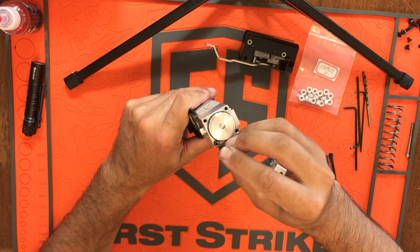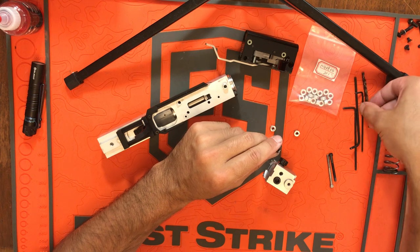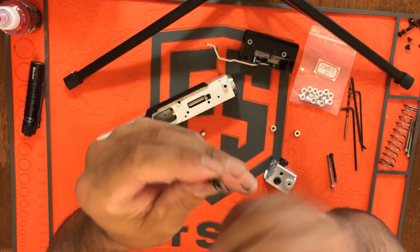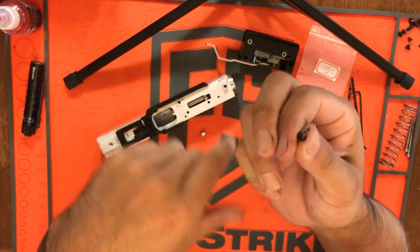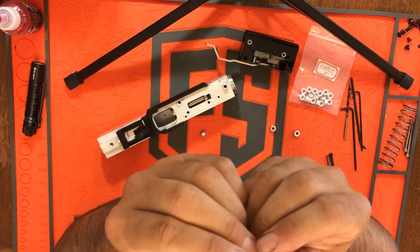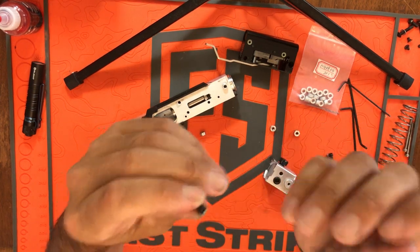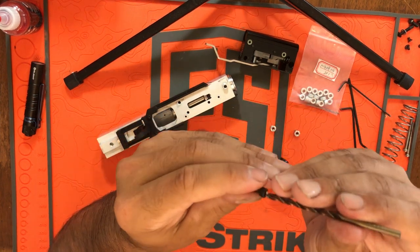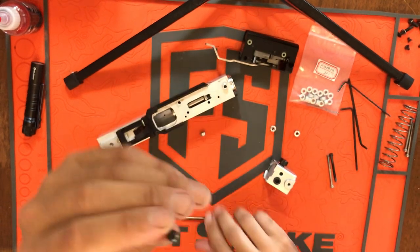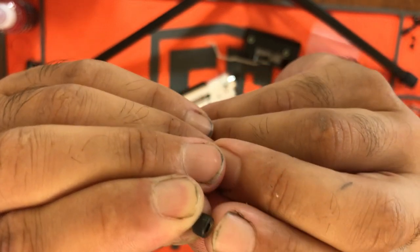Here, before I get too far, this is the part that's a little bit difficult and you kind of need a drill press for it. I took this Allen head and drilled through it to make an air hole. I used a 1/16 drill bit to drill through it, and a 9/64, and this is important if you're going to do HPA, to just divot the end of this socket head, right into the Allen head. I'll hold it up close here. You just need an edge.